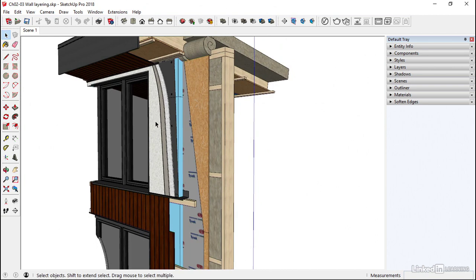It's not necessarily a waterproof layer. So we need to provide backup just in case moisture does penetrate. And it can be that it's wind-driven rain. It'll get through the gaps. It can climb up little narrow gaps through capillary action. And then it'll reach a barrier like this thing here. This is our GORE-TEX jacket. This is the Tyvek, or other types of moisture barrier or breather membrane are available.